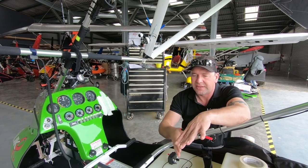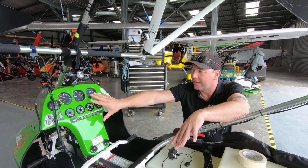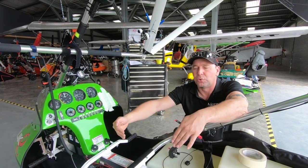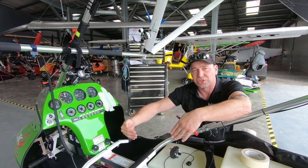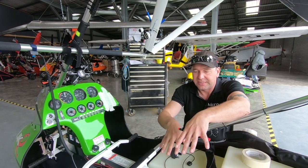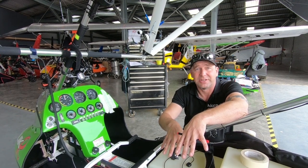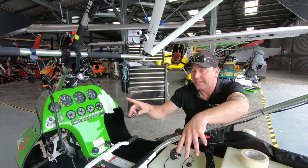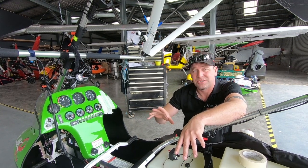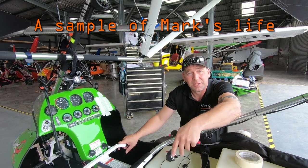We're going to move the avionics aft so that we're not cluttering up the cockpit area. It means we're able to put all the noisy cables to one side so you don't get any radio interference. We're also going to fit this with the TRIG GPS source, the TN72, and their GPS bug, the TA50. It's just a fantastic kit. We're also popping in a Pilot Aware system in this as well. So yeah,